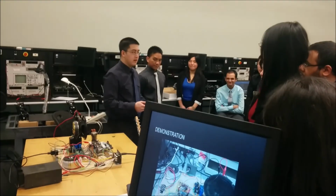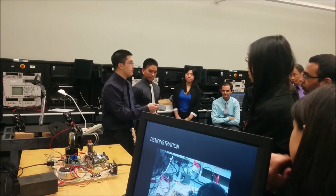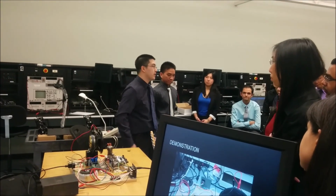This type of socket disconnects one side of the contacts when you've plugged something in. So when you leave it unplugged, there's the 10K resistor there kind of simulating the guitar and preventing the wires from picking up too much interference.